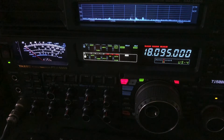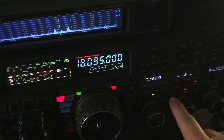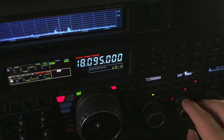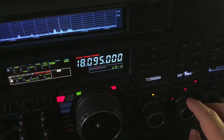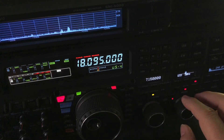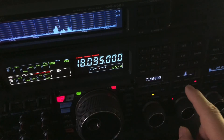So when somebody needs an accurate S meter reading, I have to temporarily turn off the things that affect it. APF will not affect the S meter reading, digital noise reduction won't. But this width here — and even though this is an FTDX 5000, what I'm showing you applies to other radios too. Especially if you get below 300 hertz, 250, you start getting down in this range and it's going to drop the S meter reading. I go for signal-to-noise ratio, but if somebody needs an accurate signal reading, I will turn that off temporarily and give it to them.